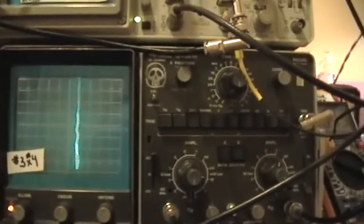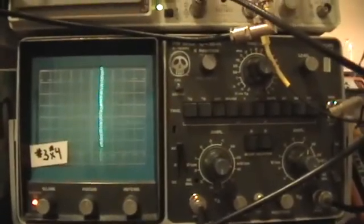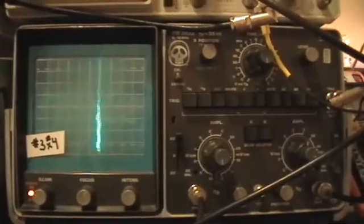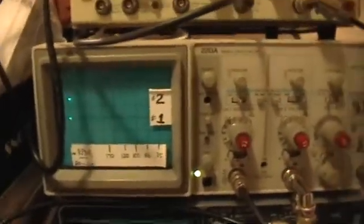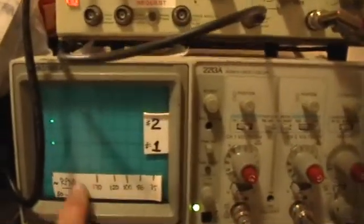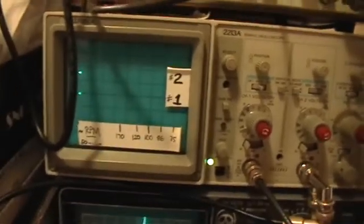I can even tell the difference between a drive that's a gear drive and a drive that's a pulley or belt kind of drive. It's easy to tell the difference between a driven and an undriven rotor using this kind of vibration sensing. This oscilloscope is the timing trace, so we'll be displaying pulses from sensors 1 and 2, and using the difference between those sensors to see a real-time display of the approximate RPM.